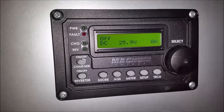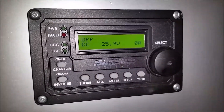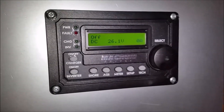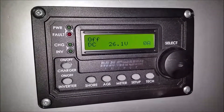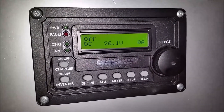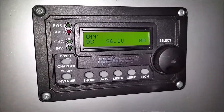I'm quite happy with this setup and glad that I upgraded. What I like about a 24-volt system versus a 12-volt system is the wiring coming in to your battery bank and to the charge controller — it doesn't have to have as thick a gauge of wire, simply being a higher voltage. With resistance, it doesn't require as thick of wire, so you can save quite a bit that way. I'm quite happy I went with the MagnaSine Pure Sine inverter — the 4024. But again, that's all according to your specific needs at your place.